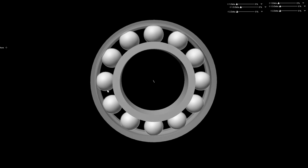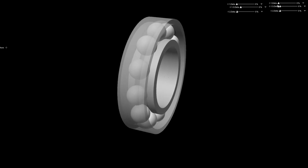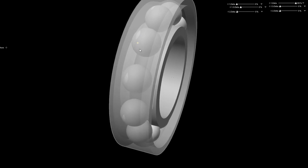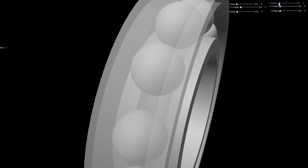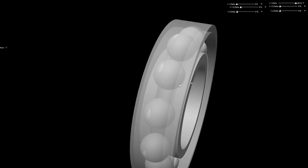So you push the inner race to one side and add the ball bearings on the other side, which is larger, and it then allows full complete assembly. And the problem with this is when you apply a thrust load to it, the actual contact patch is very small. As you can see here, that ball is clipping through the geometry, so that is the contact patch in this axis.